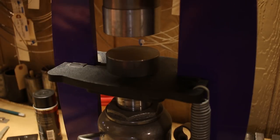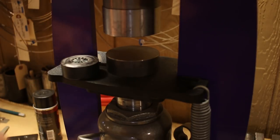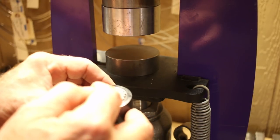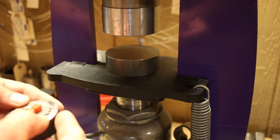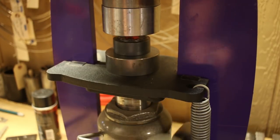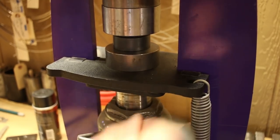What I like to do is remove it and anneal it and take a second pressing. So I'm going to do that off camera. Okay, I have annealed again, and this time rather than using one piece of urethane in the center, I'm spacing three smaller pieces of urethane kind of evenly around the design there. And we will give it another press with the three smaller pieces. This works often better than one larger piece. Not really sure why, but experience has taught me to go with what works.